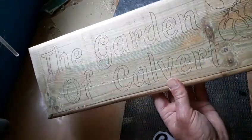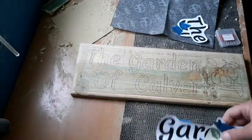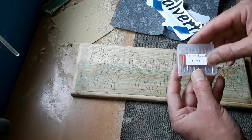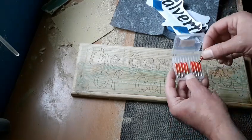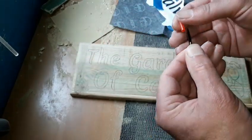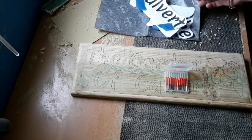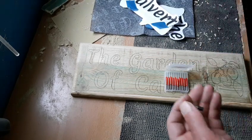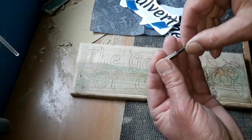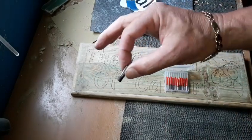You can see what we've got to rout out today. Let's look at our bits and see what we're going to need. As always, I like to use these CNC bits - these are available off eBay, Amazon, they're really cheap but they are fantastic. They're like little pins and they're ideal for cutting round the lining of where the pencil has been to start us off with. They do come with a small shaft so you will require what they call a collet - that's simply just a little tube which the CNC bit slots into, and that's got a quarter inch shaft that will quite easily fit into your router.